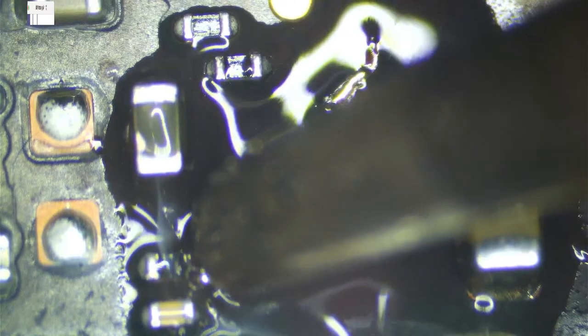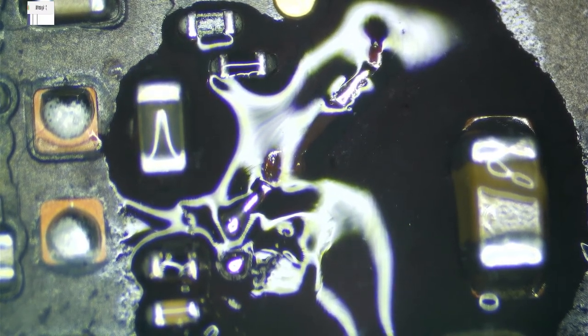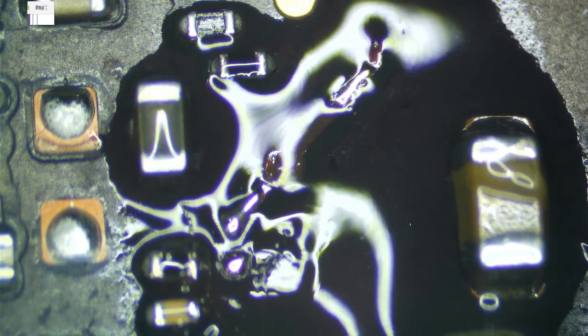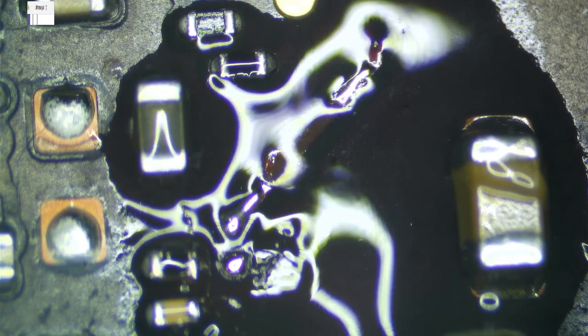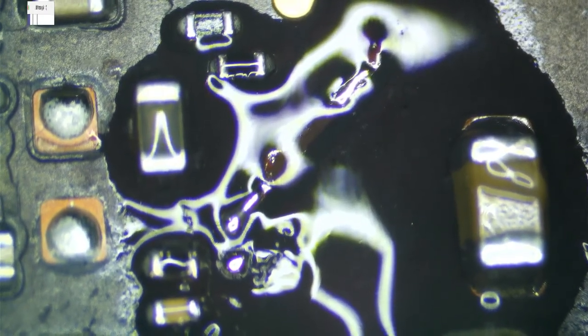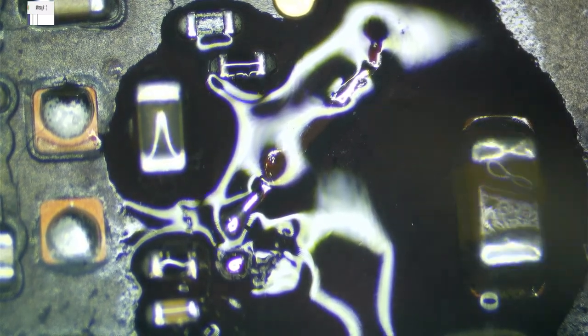I've heard from a friend of a friend of a friend that if you use a 1 milliohm resistor, the board will work just fine as well. So just putting that out there. So if you can't find a 1.3 milliohm resistor, but you have a 1 milliohm resistor, it will work just fine. But, I mean, it was from a friend of a friend of a friend that told me, so take it with a grain of salt. But I'm going to grab a quote-unquote 1.3 milliohm resistor and replace it. Get the resistor here.